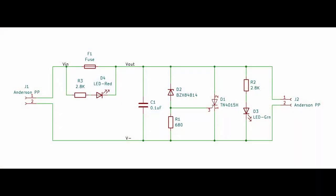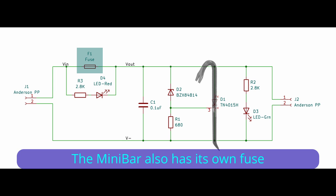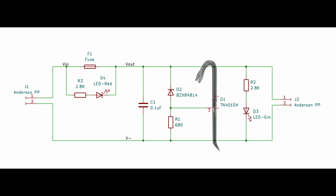This is where the crowbar circuit comes in. A crowbar circuit monitors the supply voltage. If the voltage exceeds a preset limit, the crowbar circuit creates a dead short across the power supply output, similar to putting a crowbar across the positive and negative terminals — that's where the circuit gets its name. The intent is to blow the fuse in the power supply, which prevents the radio and any other loads from seeing excessive voltage if the power supply regulator circuitry should fail.